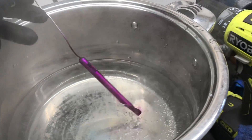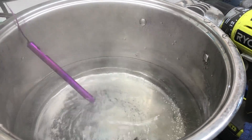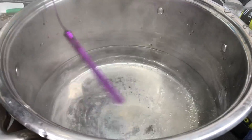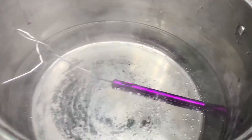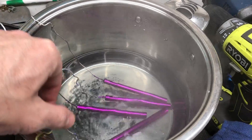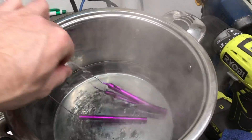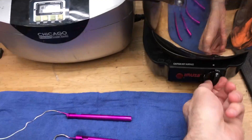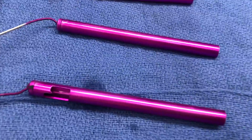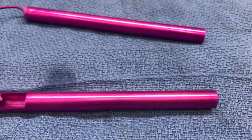I've had it where the dye washes off pretty quick, and that just means your pores are too big — I believe that's from too high of a current. But you can see here that the dye is not washing off at all, staying there. So 15 to 20 minutes in the water bath seals the pores, and then pull them out and you're basically done. Quick and dirty, pretty reliable stuff with just pool chemicals.